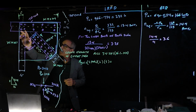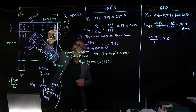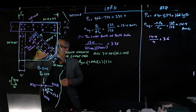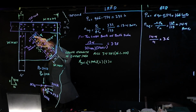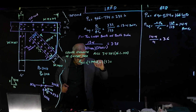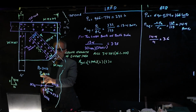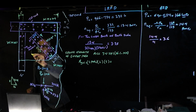We're going to have to have a bolt right here. And then what is the spacing from here? We know from here to here we have 2 inches. We know from here to here we have 2 inches. We know from up to here is 5 inches, or 10 inches to here. But remember, in the previous step we calculated this Lw, which came out to be 19.4. So from here to here came out to 19.4. So I'm going to go ahead and draw the horizontal right here.